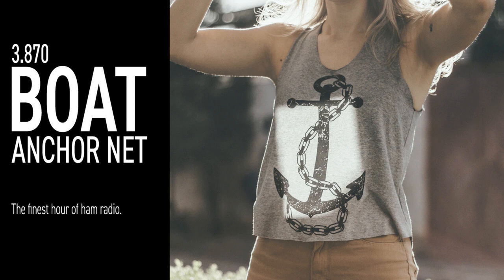Rusty, does this frequency still sound okay to you? Yeah, go for it. K5LYN returning. By the way, KG7TR Mike, who built this transmitter — I've been talking about the fact that if you've got the VFO right there in the same place with the finals of the transmitter, maybe when you talk a lot it moves the VFO a little bit. That's one reason I put this outboard VFO on here. So far, so good. Jeff, W5OMR, your Viking 2 was really good there — nice signal into Austin. This is K5LYN, Lynn in Austin on a Cheap and Easy SSB from QST 1956, built in more recent times by KG7TR. It is a beautiful piece of equipment. Who else for the net? K5LYN listening.